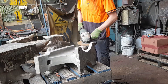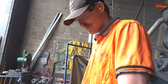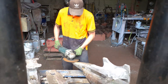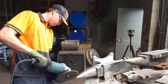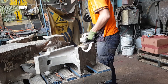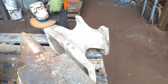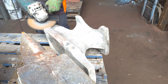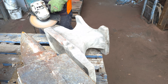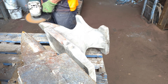Here he is — he's as fast as he's ever worked in his life. Someone had their coffee that morning. They've got a pretty big grinder there, just cleaning up the side. Obviously you probably wouldn't use such a big grinder on the smaller ones — it's just because of the size of the casting you're working with. We like to use the big grinder because it gets a lot of work done quicker. A little grinder seems to burn out because we're pretty hard on them. Takes a man and a horse to use one of those. It just goes through so much work so quickly. Jamie's pretty skilled on the 9-inch grinder these days.